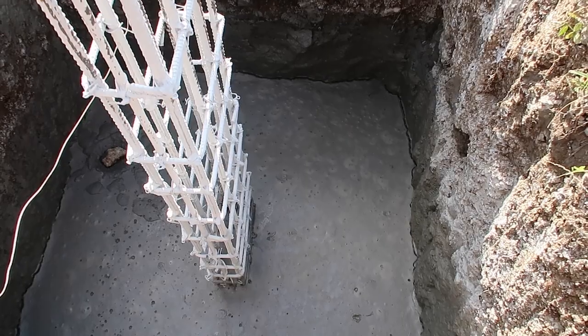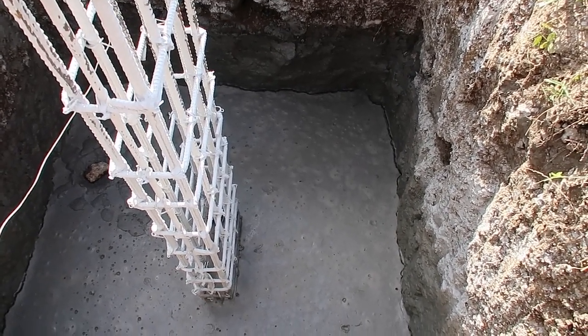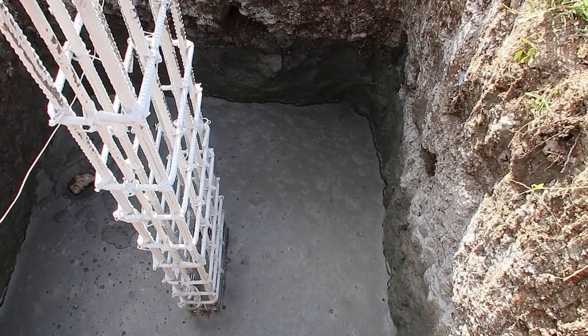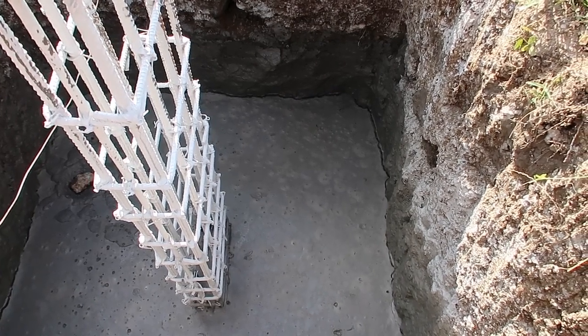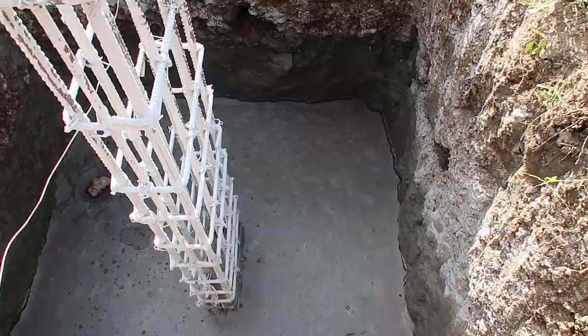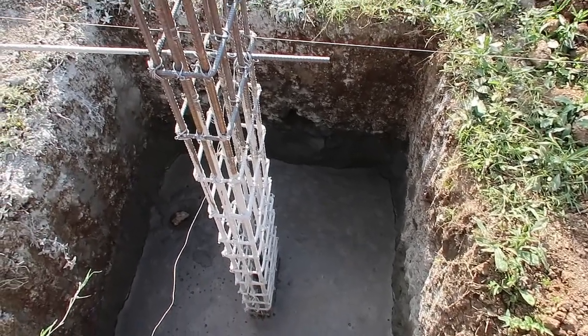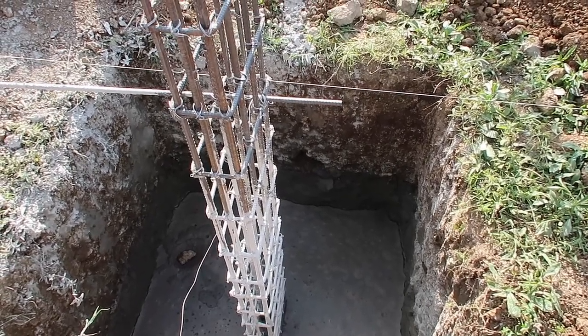This looks like a really good mix — mainly Portland cement with some sand. I guessed wrong earlier about the mix ratio. The base is a 1:2:4 mix — one bag of Portland cement, two bags of sand, and four bags of gravel. That's a good combination; it's actually the proper one. Someone on yesterday's video had commented on the correct ratios, and this is exactly what was said.